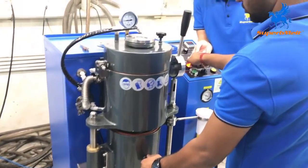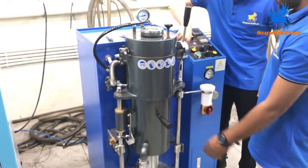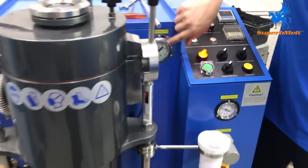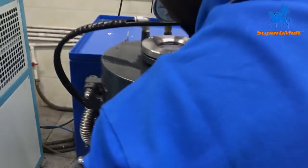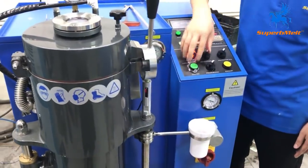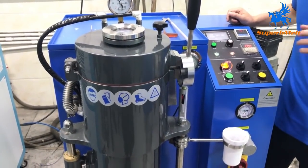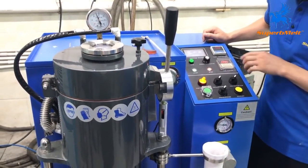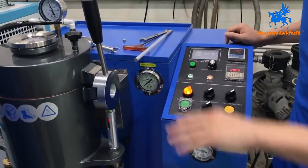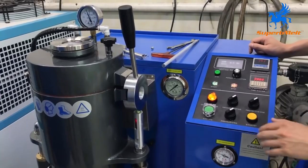Lift — casting lift here. Vacuum pump — check this, check this. Vacuum pump to the end, we can start casting. Already cast — just cast. Maybe wait half a minute, we can start the exhaust. This is automatic pressure casting — we set 3 seconds. After casting, 3 seconds of pressure.